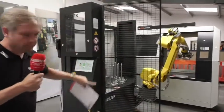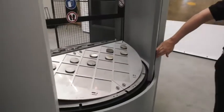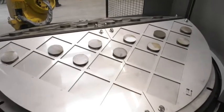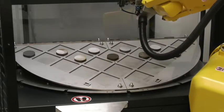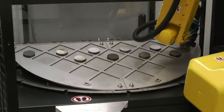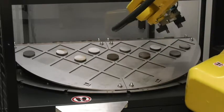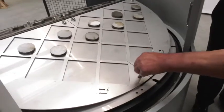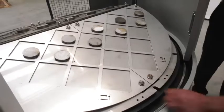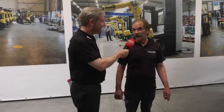Now for the big reveal — this is the universal grid system. It won't take quite as many components, but in our initial discussions with the customer we find out what they want and what their ultimate goal is. A lot of components can't run unmanned without customer intervention, so we go through that and find the best possible solution. These components are relatively flat, but you can raise the grids — for a taller component you put two grids and by moving the pin up and down you alter the height for stability. Everything here is exceptionally simple — that's the key word: don't make it too difficult.